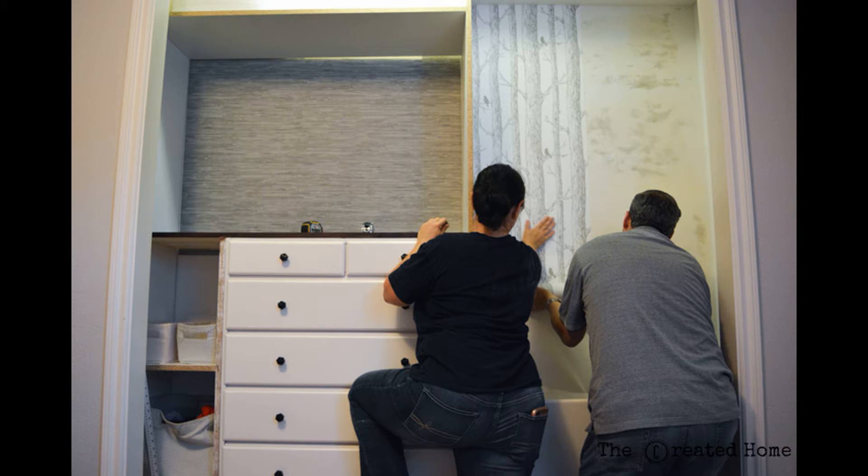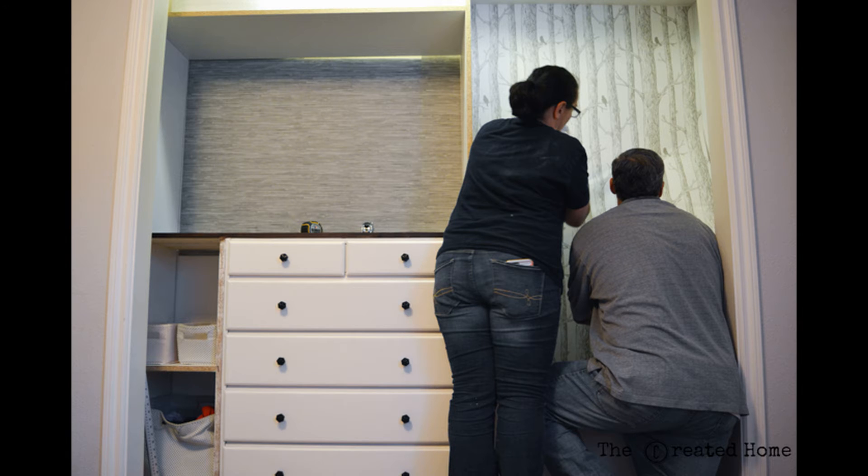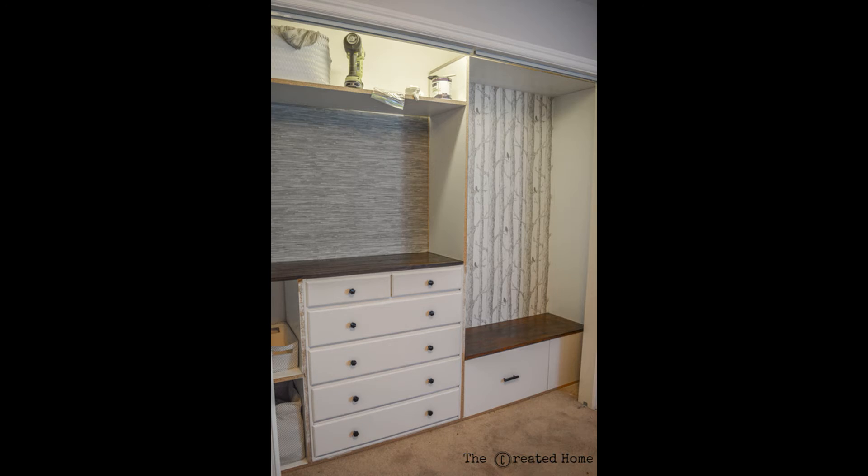New Wallpaper is a removable peel-and-stick wallpaper, which is great if you're in a rental, if you want to change your mind, or in our case if you simply just really love the designs. It is a little trickier to adhere if you have textured walls, so you'll notice that we knocked it down a little bit. That's not necessary but we found it helpful.